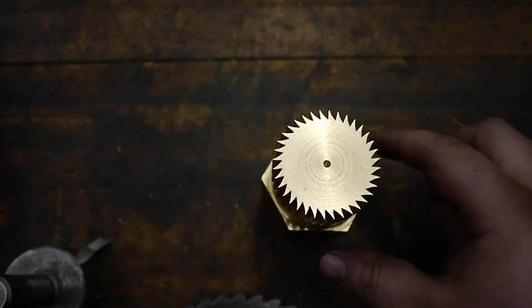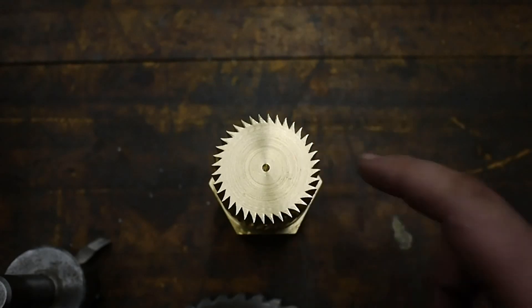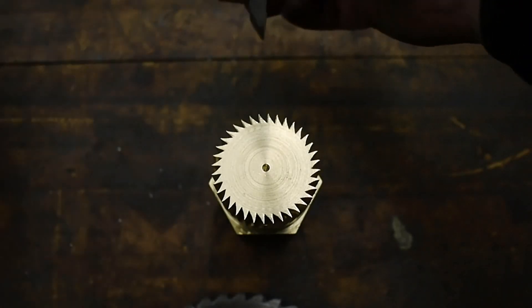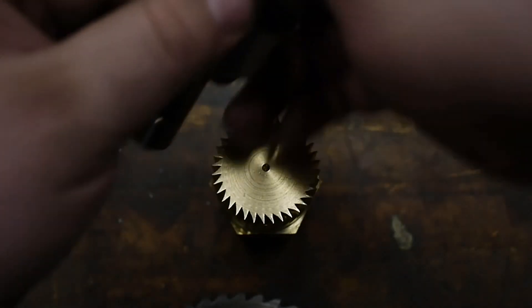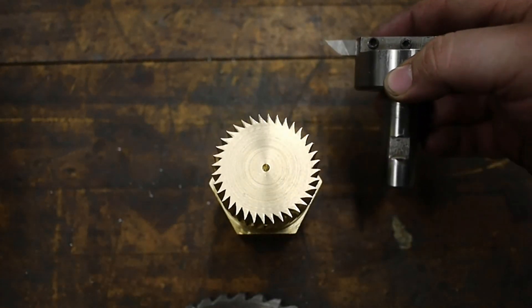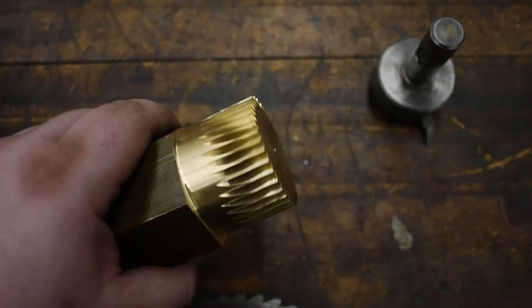Here's the finished escapement pattern — this is the top view directly down onto the part. You can see the curved radius that the part has in relation to the cutter direction, which fits directly into the path. Right here you can see I honed in the tip on the cutting tool to have a radius on it, and that radius cuts the escapement pattern.